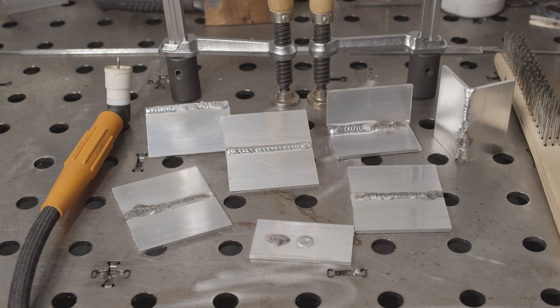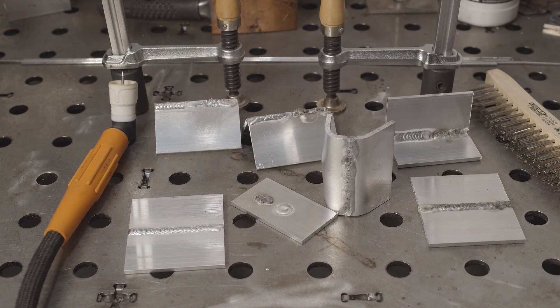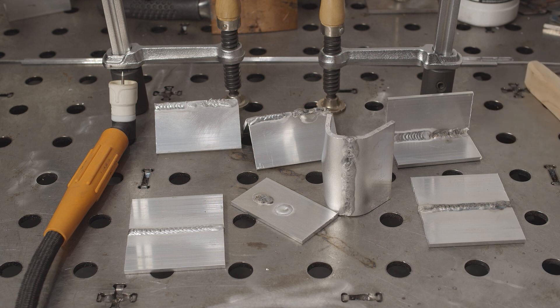It's also not great for welding thin aluminum due to the hotter arc, though it can actually be better for thick aluminum in some cases. Also be aware that due to the increased arc voltage, it pushes your welder harder to run helium than it does to run argon. So you may want to reduce your duty cycle a bit when running helium because the total power supplied by the welder goes up at any given amperage. Stick welding also has a higher arc voltage than TIG welding with argon, and many welders will have a lower output and/or lower duty cycle spec when stick welding versus TIG welding for this reason.